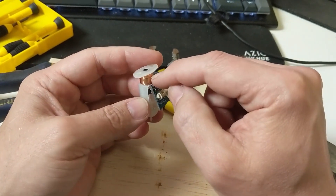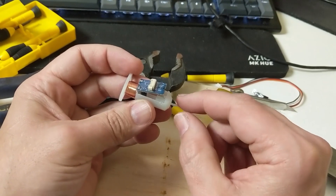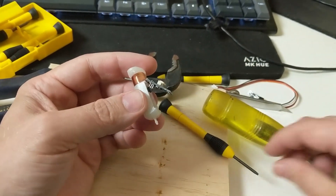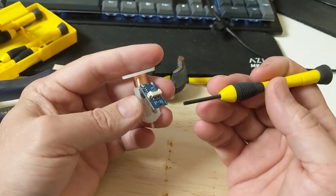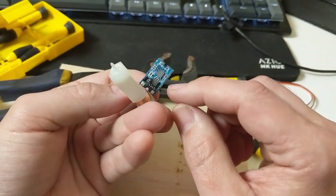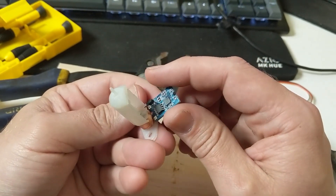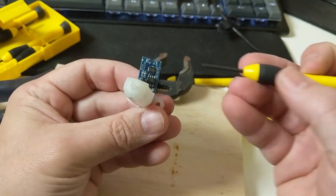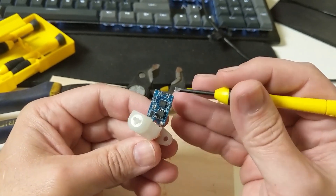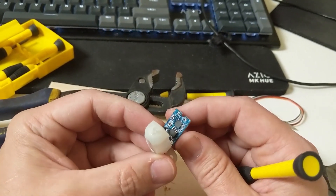There we go — that's just your electromagnet. What happens is the magnet gets pushed and pulled away based on the polarity of the windings, which turns it into an electromagnet that either pushes the magnet away or pulls it back up. When the BL Touch probe gets pushed down to the bed, it gets pushed up past the magnetic sensor — and that's how it all works. The complication is primarily in the control board with these chips. It's not just a dumb sensor — there's clearly chips that need programming, which is why the protocol to talk to these sensors is more involved than just a dumb on/off end stop switch.